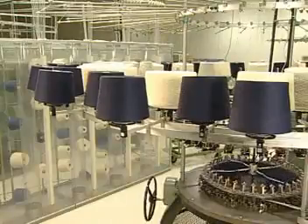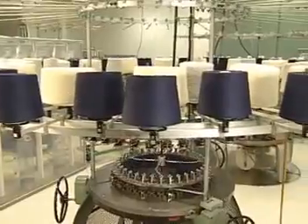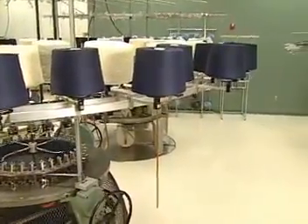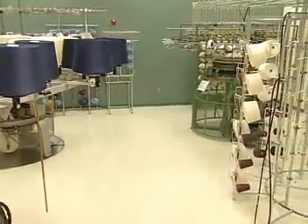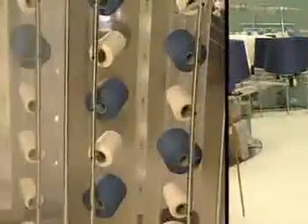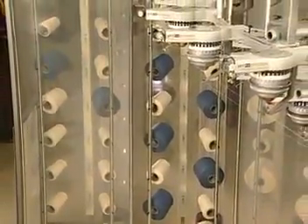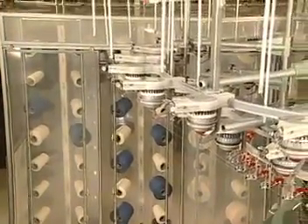Let's start by taking a look at the big picture, the basic configuration of most knitting machines. Commonly used for single knits are circular knitting machines, which pull their yarn supply from creels located either above the machine or next to the machine. To make it easier for technicians to service the creels, it is more usual to find creels located at the side.